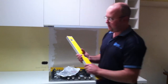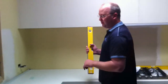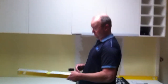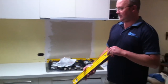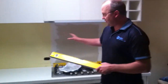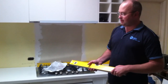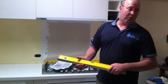It can get tricky in situations where you've got brickwork inside here and you're almost measuring off invisible lines, and you've got to try and, okay, well we can pack that up there, I'll make that level, and brick's hard as opposed to doing, this is grass, doing all the substrate work is fantastic. It falls in every time. So in the event that you haven't got, once you've established the wall's straight or a bow, then you measure it accordingly off your back wall, and then you deduct your 10 or whatever's required to pack it off the wall.